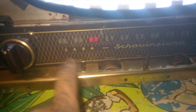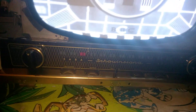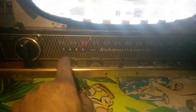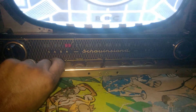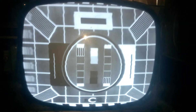I have the horizontal control all the way to the right and I need to center that. On the underside there's a trimmer pot — you put the control in the center of its travel and then adjust the trimmer until you get full lock. That way you have movement to the left or to the right to be able to adjust. Right now it's turned all the way to the right but we have a fairly decent picture.